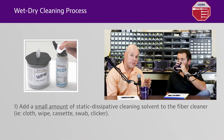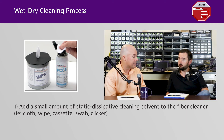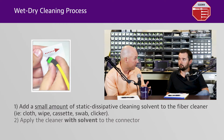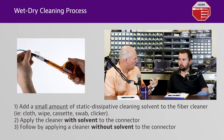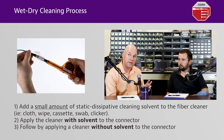The best thing you'd want to do is apply just a small amount of the cleaning fluid onto a wipe — whether it's an optical-grade wipe or even a cassette. Even if you're going to do a wet-to-dry with a clicker, you always want to use a small amount. You want to meter how much cleaning fluid you use. You don't ever want to use too much because it's wasteful, and it can actually get into other parts, like back into the cable assembly or where the ferrule is, and start wicking out and cause problems.